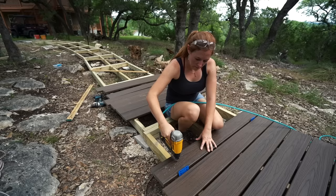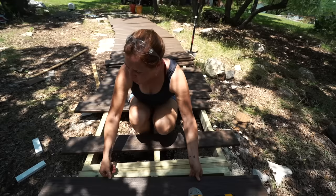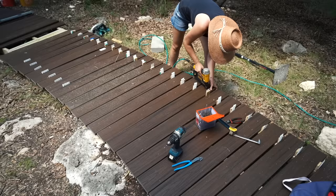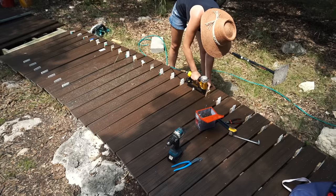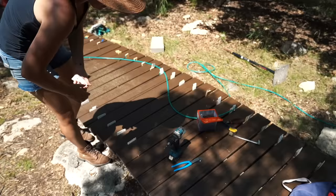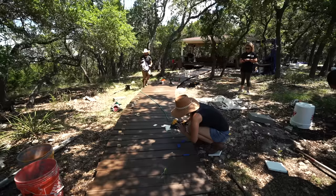When I got to the decking portion of the big curve I started playing with the spacing where it wasn't even. This unconventional project pushes a lot of standard rules out the window. You can certainly cut each board to a taper to maintain the quarter-inch gap exactly, but I didn't bother — I left a bigger gap on the outside than on the inside and it worked great. I placed all the spacers first to check the layout, then nailed the boards down. Once past the curve I went back to quarter-inch gaps on either end to straighten it out.